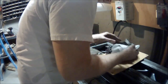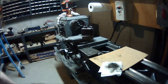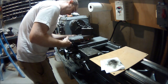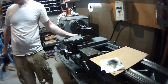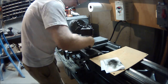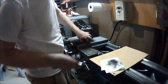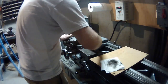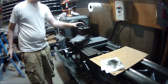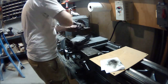Here's the compound — it was dirty. I break out the brake cleaner and paper towels to clean up so I could see the numbers on the side, but there were also tons of metal chips, so I knocked as many loose as I could. The bolts are longer than the nuts have space to consume, so when you put the nuts on you really have to tighten them down partially to get it to sit. Lots of wrenching — I should really get a set of wrenches downstairs. I turn the compound and get everything nice and tight.